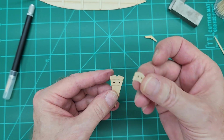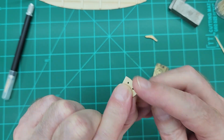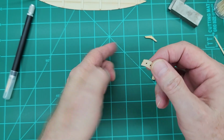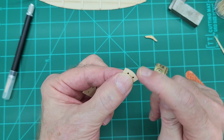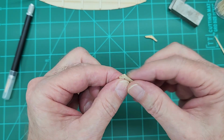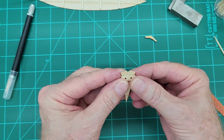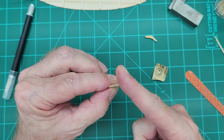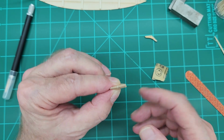And then for our cleat that goes right here, we have cleaned up the edges. And only on the face, this face is inboard here, like so, I just radiused the top edge and the bottom edge. And it is going to overhang, but I think when we put the boat together, we end up fairing all of this in. So it's going to have a bevel on it eventually.